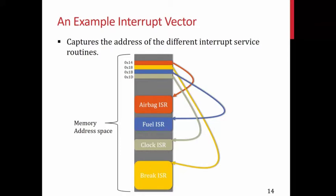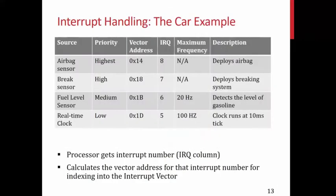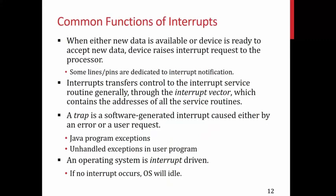in the background by the processor. Coming back to this, when the device raises a request, you are telling the processor that now I want some attention. Correct? Depending on the type of request, if the request is through the serial port, then the processor will receive a serial port interrupt request. If the interrupt comes in through a GPIO pin, then the processor knows that it is a GPIO interrupt request. So what must you do beforehand? You must update a vector table.